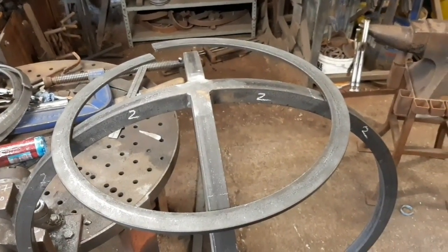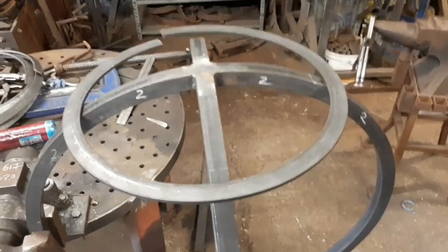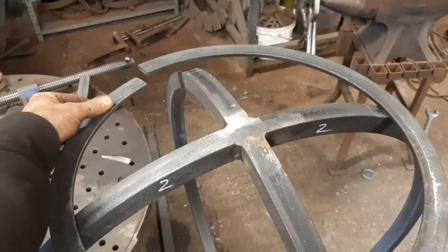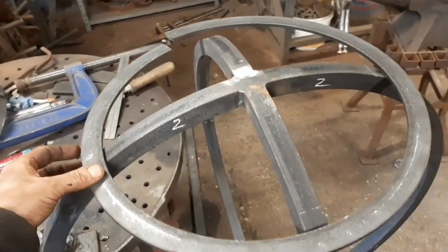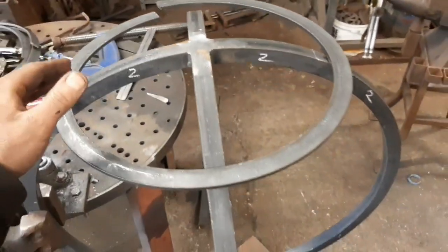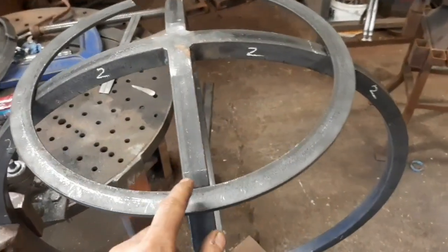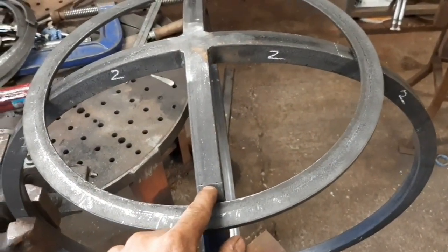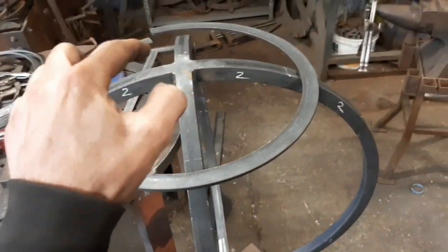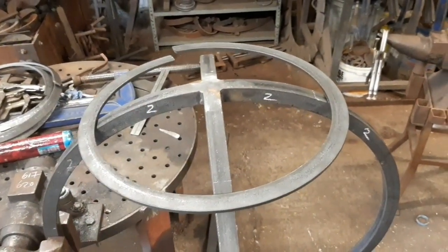So again, this method is not the method that the book says to do. It's just one that I've sort of found that works. Now, as you come into bending it on the easy axis, I'm not worried that there's springing up. As you come onto bending it on the easy axis, it's going to tighten up. So the top of the hoop is meant to be here and up here and up here, these ends are going to start to overlap, and basically what I'm going to do is cut the excess off as I go until it's all sitting right.